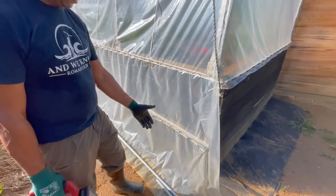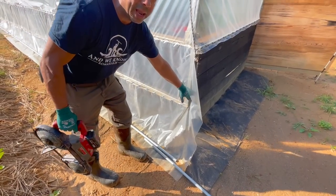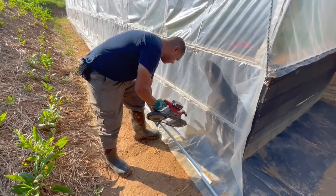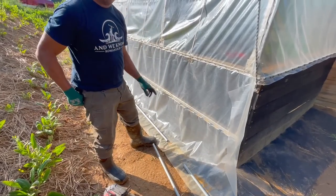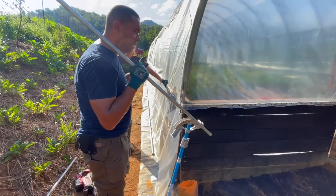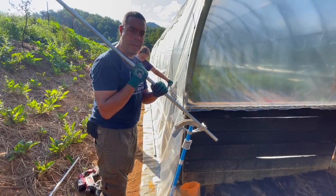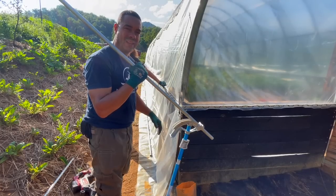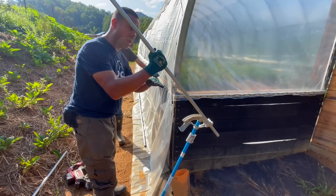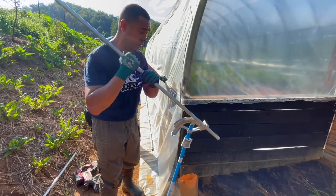This thing's about 50 feet long. The problem I'm running into is I've got to make an offset handle on the other end. This comes right up to the edge — I can't work with that. So I'm just going to cut it back a little bit, bend another offset, and then we'll be off and running. I'll put this on the bandsaw and remember — ream the ends of your pipe, you'll be glad you did. I was initially going to put one crank handle on this, but I remember Danny having one on both ends. I did see one at a place in town where they had one on one side — it was real janky. So it just makes sense to put one on both ends so I know for sure it'll crank up easy.